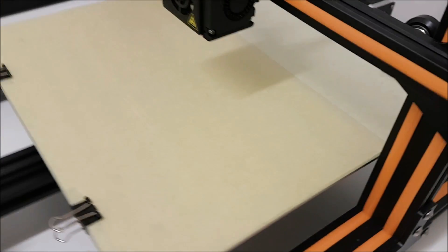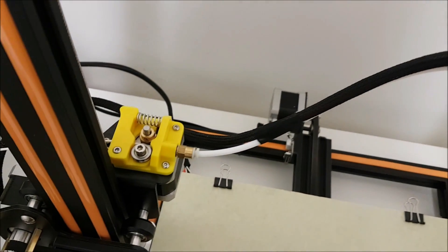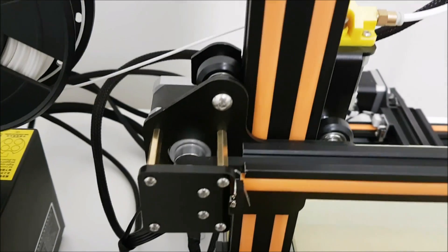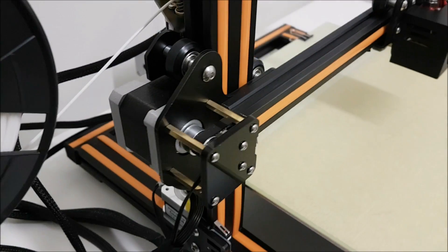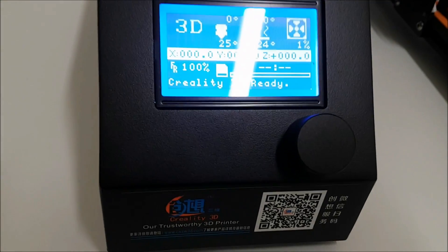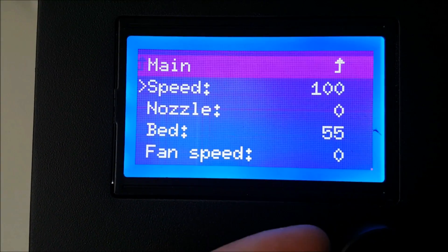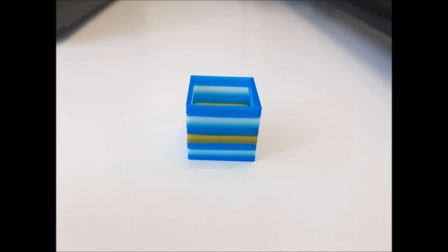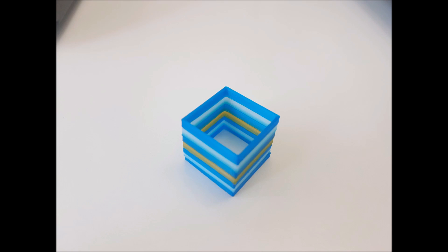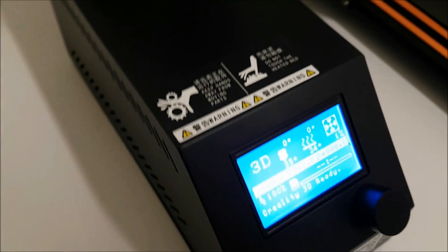There is something more I like about this printer: the option to change filament while printing. In the middle of a print, multiple times, you can stop the printing, change the filament, and continue printing at the same height in the same spot. What does that give you? It gives you the opportunity to print multi-color prints without needing to change the G-code. Just pick the object you want to print, stop where you want, change the filament, continue printing — do it as many times as you want and get pretty nice multi-color results.